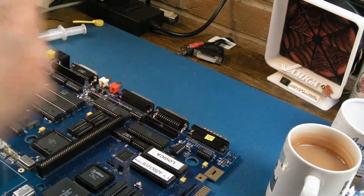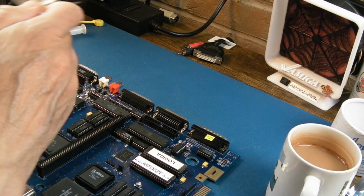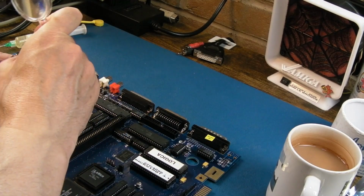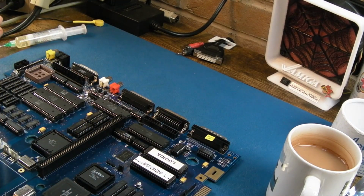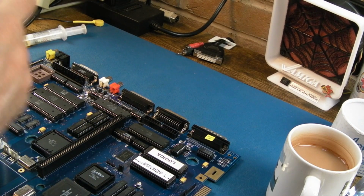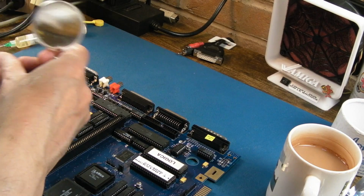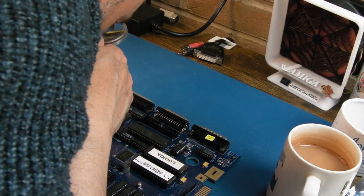Anyway, yeah, the thing is, I'm not very confident because we're still getting this resetting thing. When I was testing with Amiga test kit though, that wasn't happening. After doing a RAM test for about 20 minutes and no issues, it didn't reset. But one thing I did notice is it was saying there were some spurious interrupts. So something on here is raising interrupts at the moment.